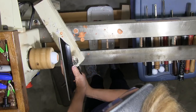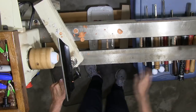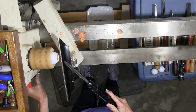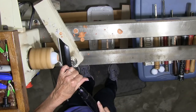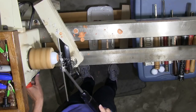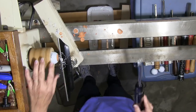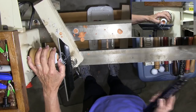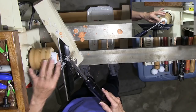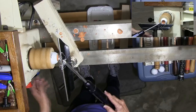Now I'm going to use my spindle gouge to true this up a little bit, and then use my Easy Wood Tool to hollow it. If you already have the lids made, it's nice to do this part first and then make the lid, because then you can measure the lid to fit the opening. Even though you're using the drill bit, when you're truing it off sometimes it goes a little deeper and wider, so it's easier to just do it this way.